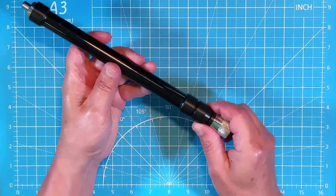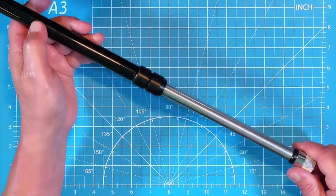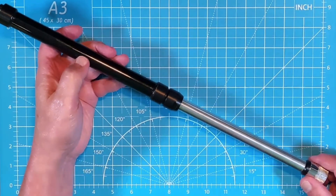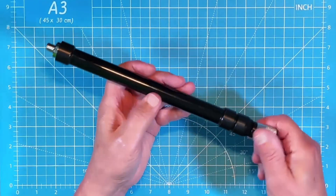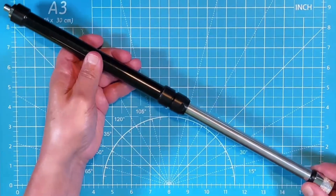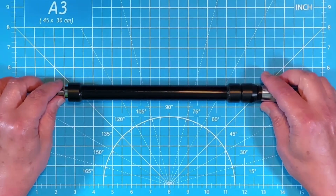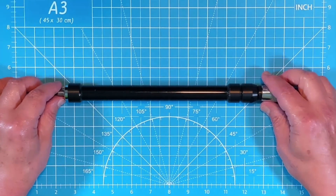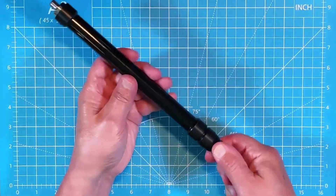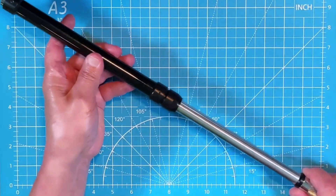So what makes me want to compare this Gabriel to the Wolf River coil or the Super Antenna? It's this right here. There is a polycarbonate nut on the bottom. If you loosen it, look at that — it is this activity that takes you from 10 meters through 20 meters. This part of the antenna is what's supposed to make you able to operate on 6 meters. So 6 meters, then 10 through 20 is right here with the addition of that collapsible mast. It's not until you get below 20 meters that you need to put that loading coil on. We expect it to be a little bit inefficient — we'll find out. But the way this thing operates, I'm not seeing toy box; I'm seeing a variation of the Wolf River coil. So now I'm intrigued.